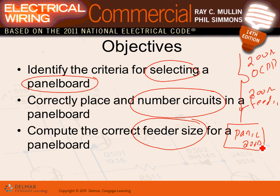That's in a perfect world. Now, what dictates the whole situation, guys, is the overcurrent protection device right here. So now, look at this, 200 amp, 200 amp, 200 amp. That's ideally the perfect design. Feeder, overcurrent protection device, and panel the same size. When they say the panel, they mean the copper or aluminum inside the panel.